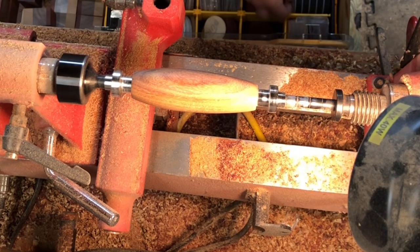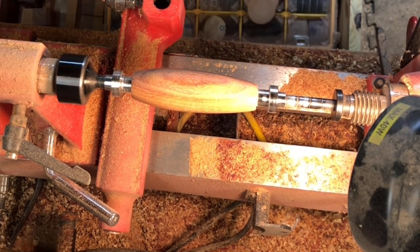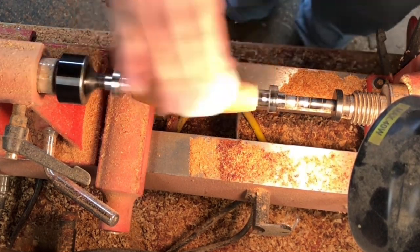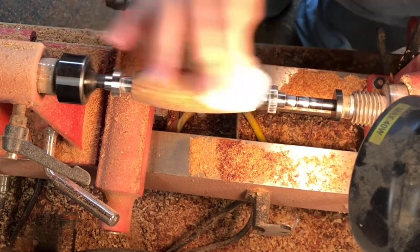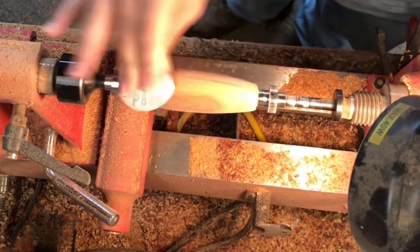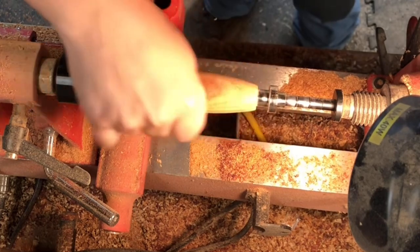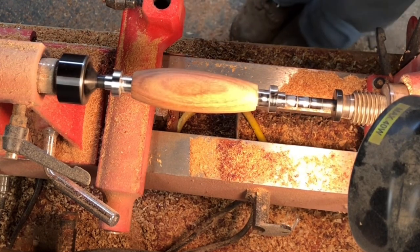I normally like to finish off by hand with a piece of 800-grit paper — that gets rid of any swirl marks left by the drill at 600 grit. Just go over this really quick by hand, nothing crazy, just light pressure. Wipe some of this dust off, and that piece of Pau Rosa there is looking pretty good.